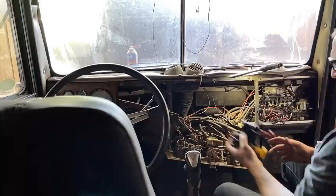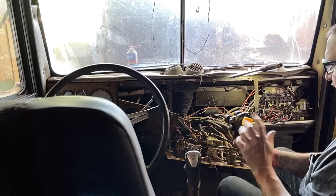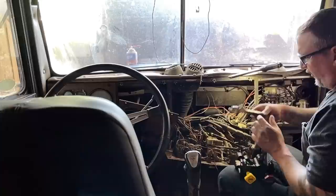So we're switching out the brake valve. Now this is an MV2 valve. The difference is the MV2 pins on, the MV3 screws on. Basically we marked all the lines and we marked the hoses. This is something that we're gonna do from now on.